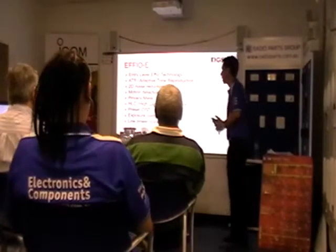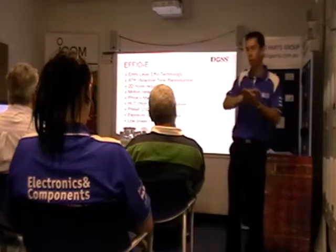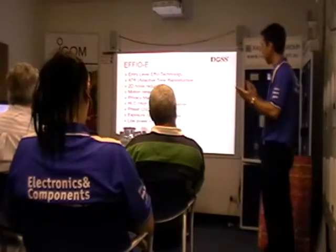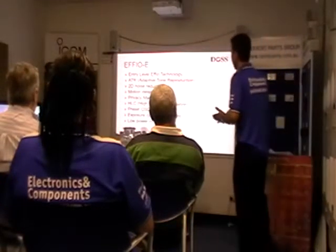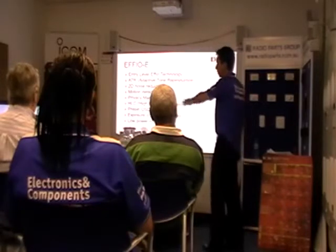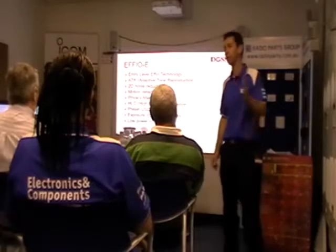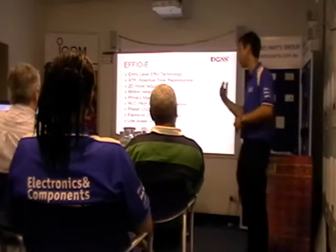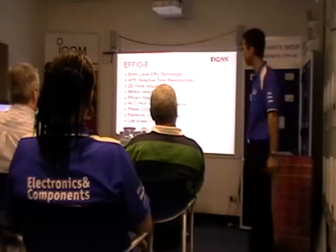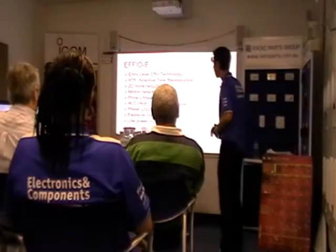2D noise reduction is on a still image. For example, in a doorway, it'll just clean out the image a little bit, on a still image usually. Motion detection, it has got motion detection in it. You can access it via the menus of the cameras, but obviously the DVRs will have motion detection. You would normally set it up via the DVR because you can set up your schedules. You can set up 8 hours of motion detection at night and then normal recording during the day or something like that. But it has got the option to do it.